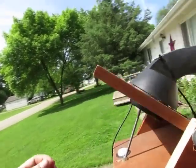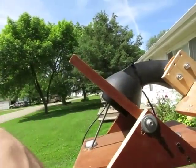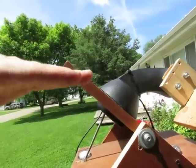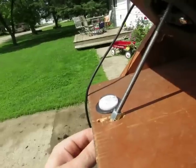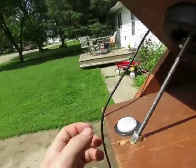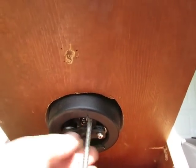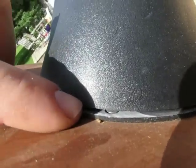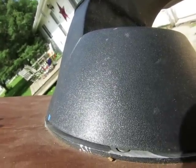I drift align by taking a few exposures and seeing which way my trails are going. I made this plate for about 45 degrees since I'm at 43 degrees, so I need this adjustment to make it perfect for whatever angle you're sitting at. I took a coupler, drilled a hole, and drove the rod through — it goes up and down through there. I kind of screwed up and made this hole too big, so I had to put a screw in and machine it level. I haven't actually seen an exposure ruined by that yet.